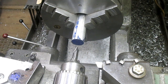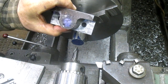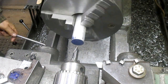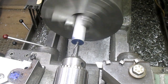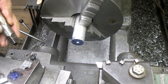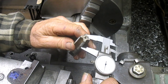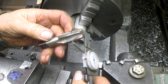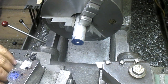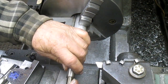Before we do anything at all, we're going to drill a hole in aluminum and make sure our hole size is correct, because we've got a lot of time in this little block and I do not want it to be the wrong size. First thing is to take a general measurement of our cutter — coming about halfway up, we're looking at 750, so three-quarters of an inch. I'm going to start with 21/32nds to give myself a little leeway.